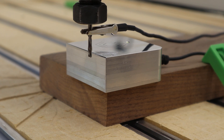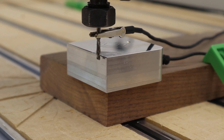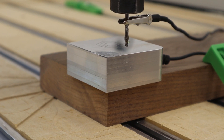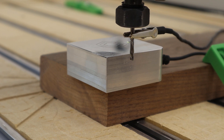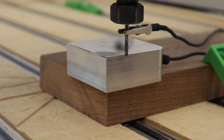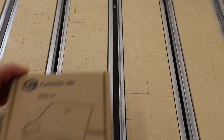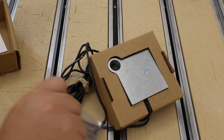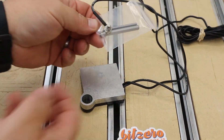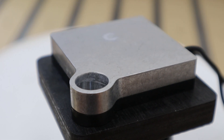To put it simply, what the Bit Zero is doing is effectively closing the electrical circuit between the bit and the block itself. That tells the controller board to stop — this is the point where we've touched something. It then uses calculations to know it's touched the top of the block, which is a known distance from the top of the wood, and does the same for left/right or front/back depending on which corner you're zeroing from. Carbide 3D has since released a version two Bit Zero that has the same core functionality.